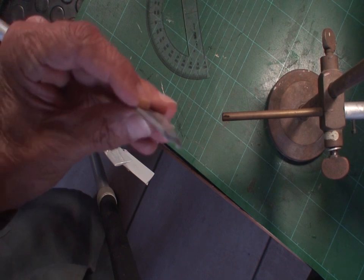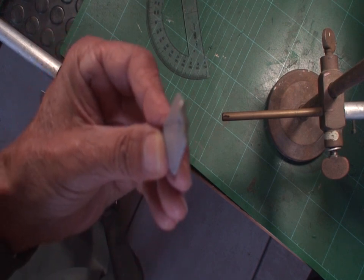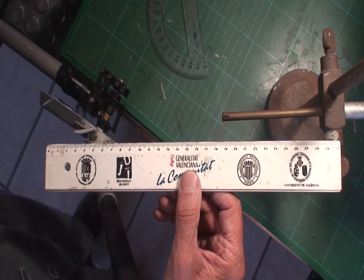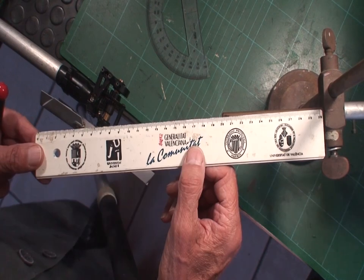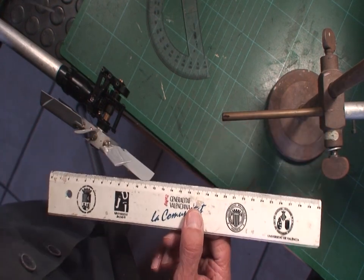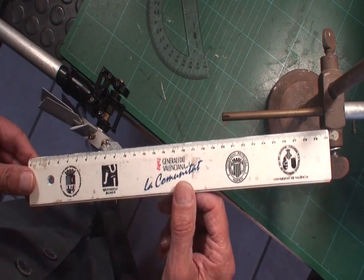Because we have observed the following: these old blades have the support a little twisted, and I have been curious to see what angle was gained simply by the change of the blades. To do this, I have made this measuring gadget that you are going to see here. Here I have the old blades — this is the flat convex profile. I put the ruler so that it is in line with this bar and with the chord of the blade, and I see where it marks on the ruler.